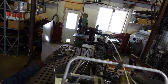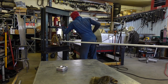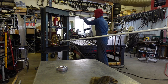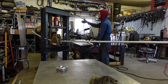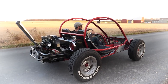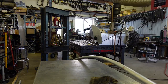I need to make an arch that goes out and also comes up — so I need a very gentle radius in that. The tool I'm going to use is this tubing roller. I'm not going to use my bender because I need just barely a roll in it. This is something I made or remade to function in a press. I ended up using the same setup to do the bars on my Volkswagen — those nice curving angles. You can bend some pretty nice radiuses with that.